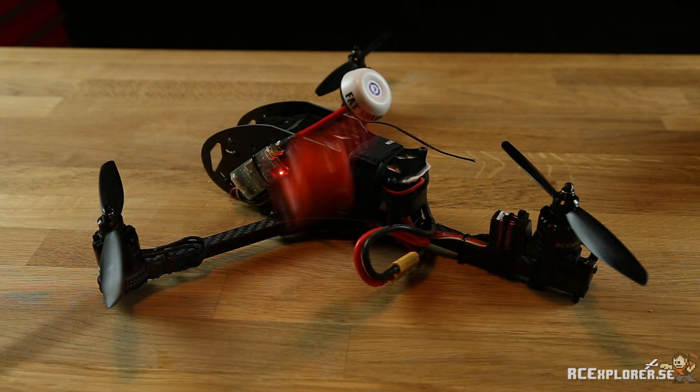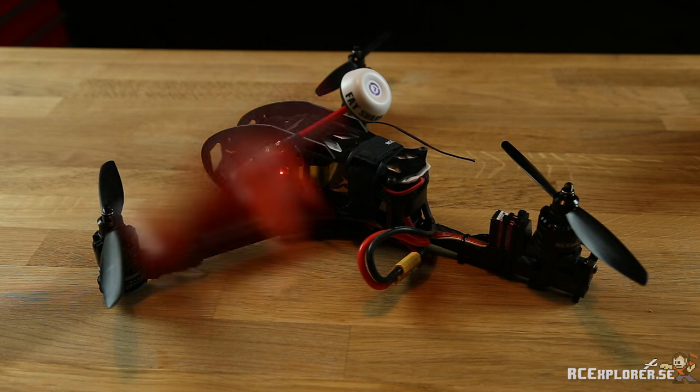Okay, this is going to be my first ever safety video, so pay attention. It's really, really important that you never ever plug in your copter to the computer while the power is still on and the props are still attached to your copter. Otherwise, the copter might freak out and the props start spinning and you get it in your face or in your hand, and it's really painful.